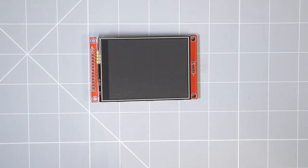If you want to get hold of one of these screens, I'll put some links in the description below. Most generic LCD panels will work — just make sure you know what driver chip your panel uses, and if possible use the ILI9341, as that will match up with what we're doing in this project.